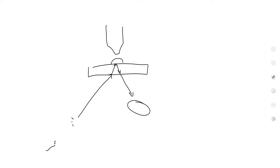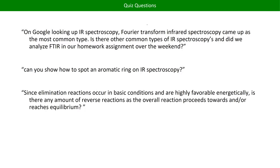I think we probably still have a few of those salt crystal plates in a clamp setup. There's one tiny little hole in the middle that you have to fill pretty exactly, or else you get air in there and it messes with things. So the new school way of doing things is to do an FTIR, a Fourier transform system, rather than a traditional absorption spectroscopy.